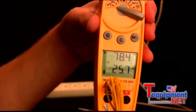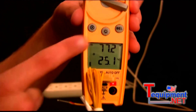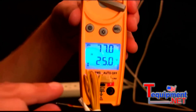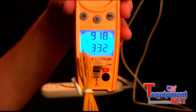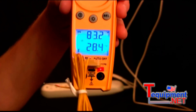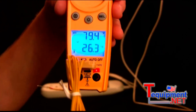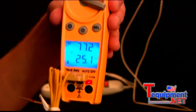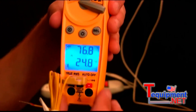It will display the temperature — it's about 78 degrees in here. This is a very fast reacting temperature sensor. I can pinch the tip of the thermocouple to heat it up and you'll see it jumps to 91 very quickly, then as I let it go it drops back down to the mid-to-high 70s. This is going to help when you're going from a hot roof down to a cold basement — you won't have to wait for that temperature sensor to stabilize.